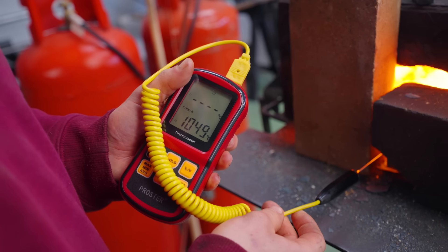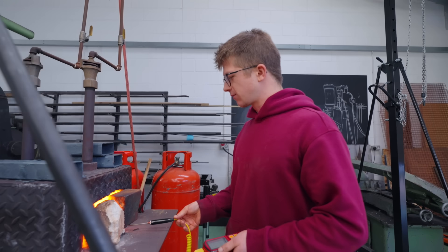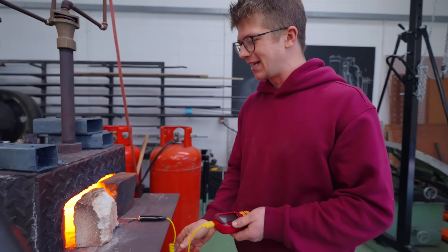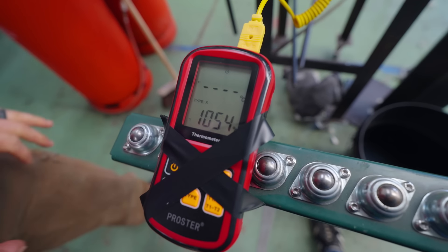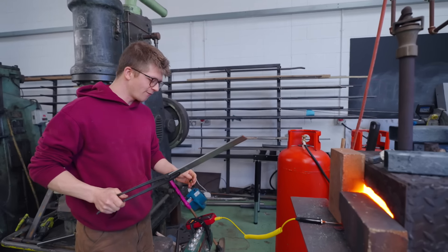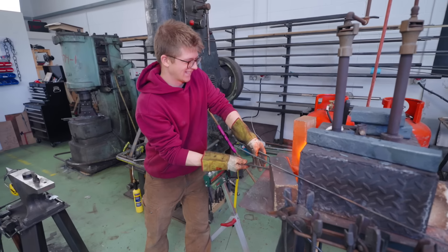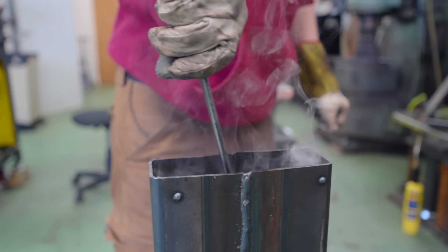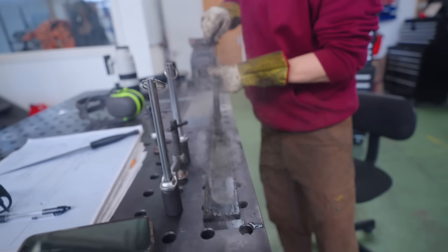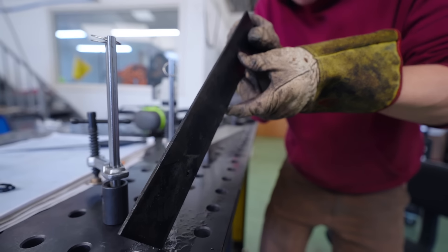1053 — too hot. I'm going to tone it down just a touch. Got to make sure we get temperature readings from both sides, make sure both burners are firing about the same and we've got even heat. It's still rising a bit fast — cool our jets a touch. Almost got the right setting. 1052 degrees Celsius. I need to set the bricks up identically, pop it in there, let it get up to temperature, and hold for five minutes. I just realized I didn't put it in any foil. It's been five minutes — 1051 degrees. Let's quench it. Hopefully it stays straight. It's got a little bit of warp — hopefully she straightens out nice. Oh, it's actually bloody perfect. That's going to be the straightest blade I've ever made.